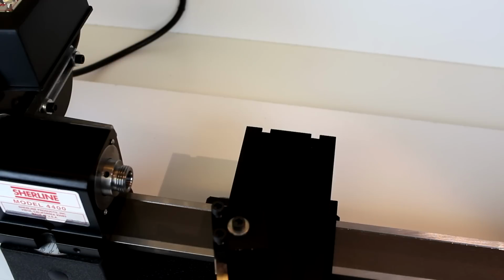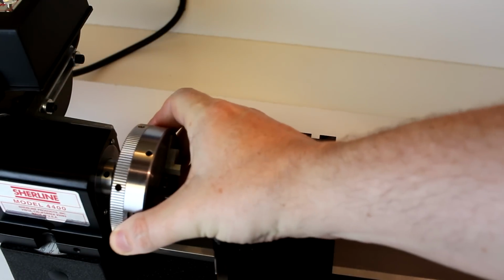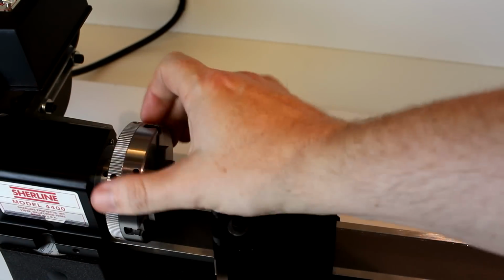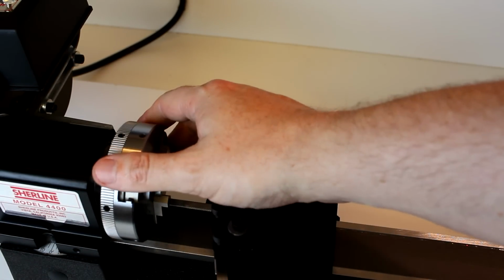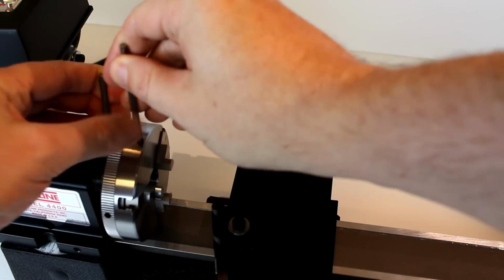So in this Lathe 100 series, we're actually going to start going over some of the operations of the lathe. This is kind of what you've all probably been waiting for, the moment you get to start cutting some metal. We're going to begin by installing the 3-jaw self-centering chuck. Spin that on, get a couple of the Tommy bars here, and tighten it down.